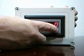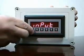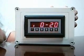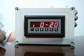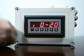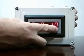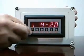By pressing the program button, it will go into the menu labeled input. By hitting enter, it will offer you a number of selections. At this point, the operation of the program button changes to one of selection. In this case, we want to set it up to receive an input signal of 4 to 20 milliamps. So I'm going to press the program button until that display appears. You'll notice that it's offering me a variety of inputs. When I get to the one that I want, I press enter.